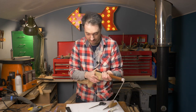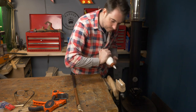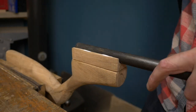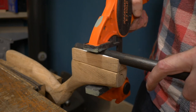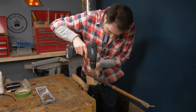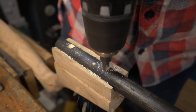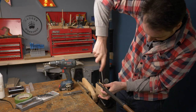Now we can get it put together. Now I know it's going to work, I can get some glue applied to that bit on top of the stock and get the black piston part put into place and clamped up. When the glue's dried, I use this drill guide to drill a couple of holes and get them countersunk — linked down below to this little guide. Then I get a couple of brass screws put into place.